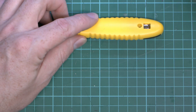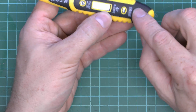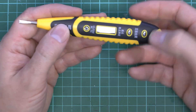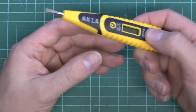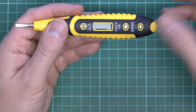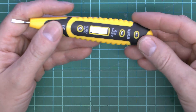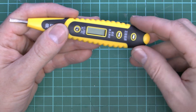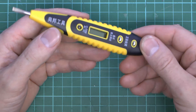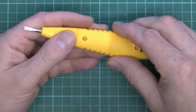The problem with these devices is not the fact that they're necessarily unsafe because, if it's made correctly, it's relatively safe to press this here. The problem with these devices is the fact that they're just so unreliable. You've got this thing where it's supposed to sort of detect things without any contact, and even when you're in contact with it there's a whole load of factors which could affect whether it actually displays things or not — just the same as those manky old neon screwdrivers. And of course as usual on these videos there's going to be 100 people rushing in to say that they've been using them for 50 years with no problem whatsoever. Well good luck with that, because in reality even when these things do work they're not actually telling you anything you couldn't find out by using proper test equipment anyway.